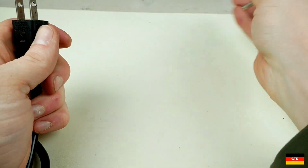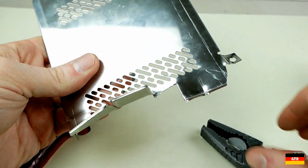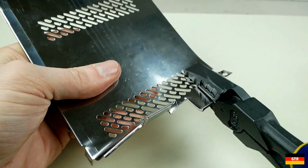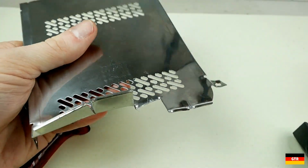If you're wondering how the shearing action compares to the typical nipping action seen on most pliers, it really comes into play when cutting very thick flat material like sheet metal. Combination and linesman pliers can certainly make a mark on the material, but don't have enough of the pliers making contact with the surface of the material to actually shear it.